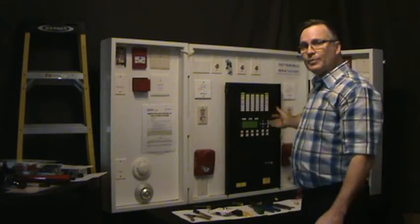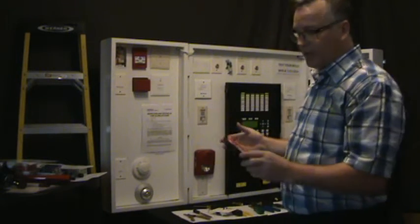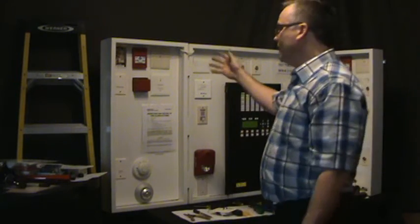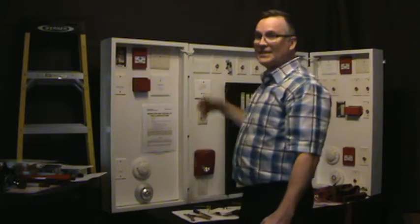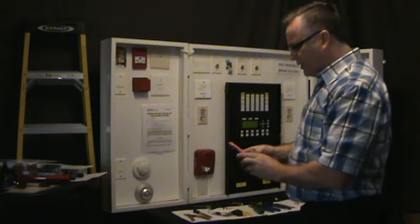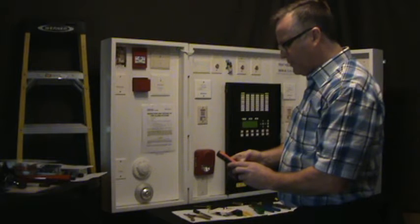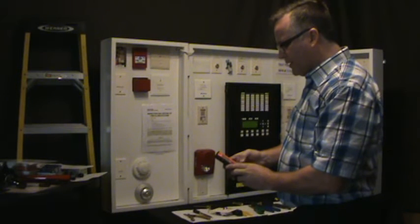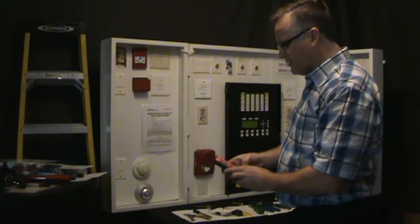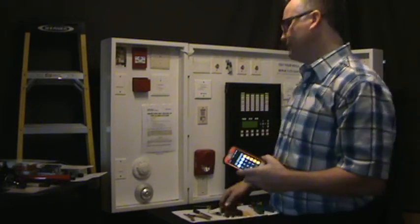Now you've also got a guy at the panel for the same thing. So I don't know how many isolators you've got in your building, but we're at 8.5. We're at 17 minutes to basically test a set of isolators. 17 minutes. I want you to remember that, 17 minutes. Okay? So, if we're going to do 17 minutes, let's figure what that costs the customer. 17 minutes divided by 60 minutes times $100 an hour, that's what you get. It costs $28 to the customer to test that device.